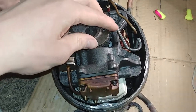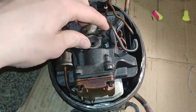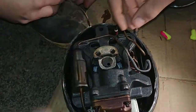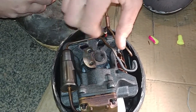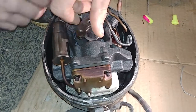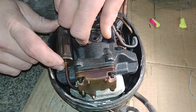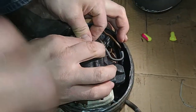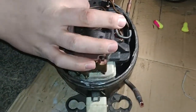The oil inside this thing lasts long enough and stays stable enough to keep everything lubricated. This is different from a scroll compressor — this is your more traditional reciprocating type. It gets stuck, but once you get it rotating it'll just keep going. I think there's some kind of bearing that's sticking. We already knew this failed, so — we have the new compressor installed, we're just waiting for it to break down.